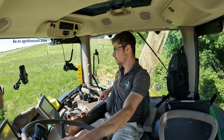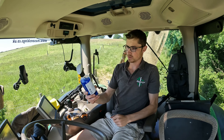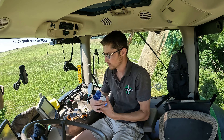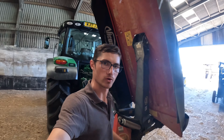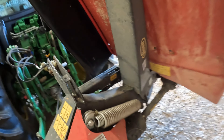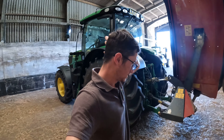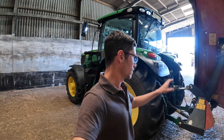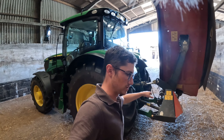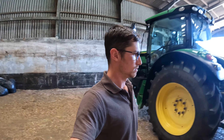I need to put the rake back on for tomorrow but I might not do that tonight - I might give the windows a good clean up with the window and glass cleaner. That's the blue one, very nice, smells amazing. If you have a Vicon mower like we do here, there is one very important thing you need to do before you decide to unhook it - that is to remove this chain off this spring. You think that will make no difference whatsoever, but if you unhook with that chain on it will go absolutely fine. When you come to hook the machine up again with that chain on, you will not get it on there - it tensions the headstock to the mower so every time you try and lift it, it just pivots. By unhooking it the headstock will come off completely level and it is a lot better.